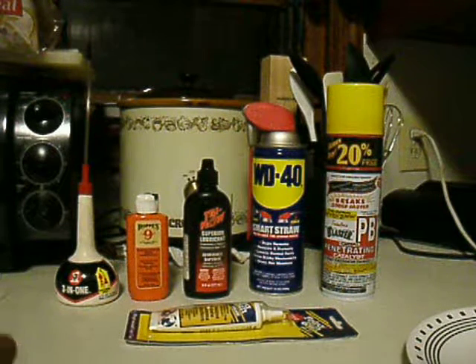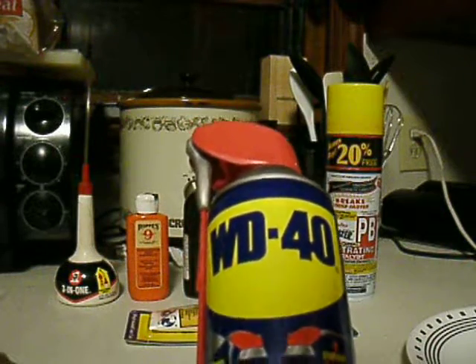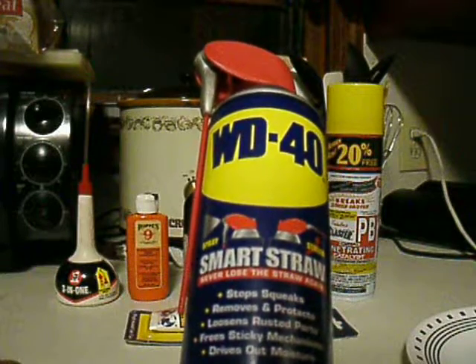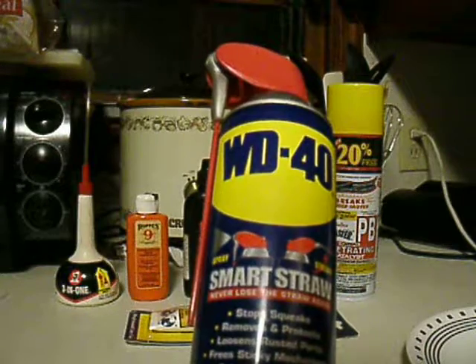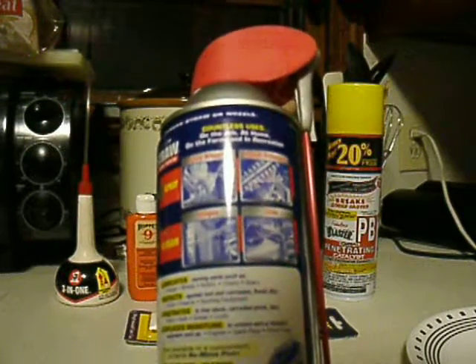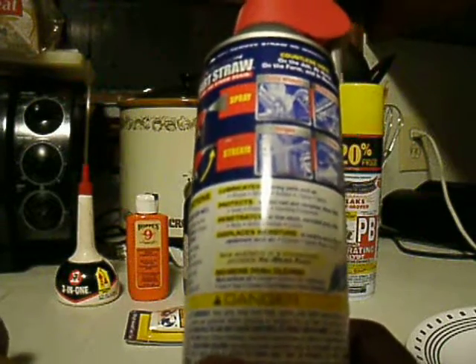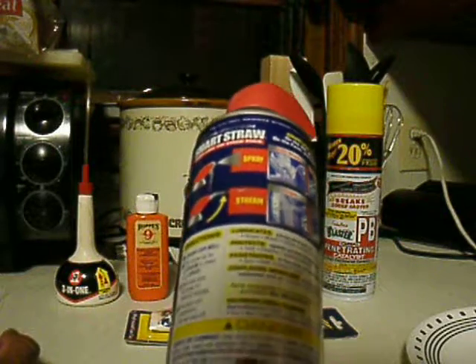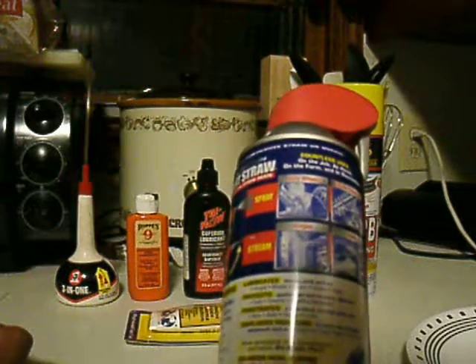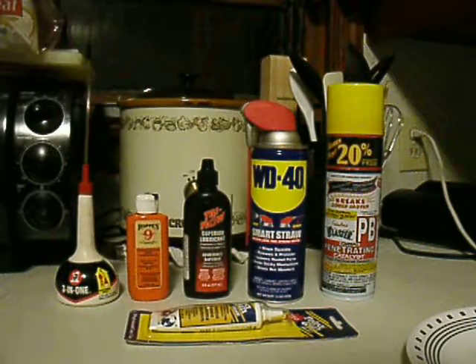Now for some solvents. We have WD-40. We all know about this — hopefully you have it in your garage or toolbox. If you're a mechanic, professional or otherwise, you at least have a can of WD-40 lying around. It drives out moisture, so if you have electronics that have gotten wet or engine parts that need it, it's useful. I remember reading ads about using it on circuit breakers. The older formula was actually flammable — this one isn't as flammable as before. You can use it on spark plugs, nuts, bolts, valves, locks. It protects tools, firearms, and sporting equipment. It's a lubricant and a penetrant, but it is light duty.